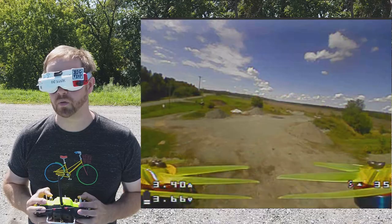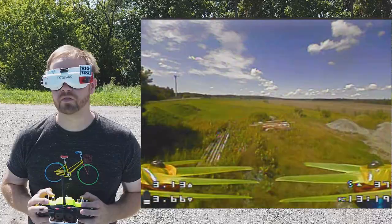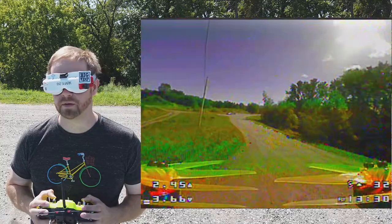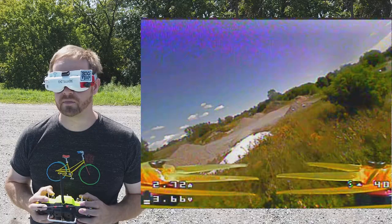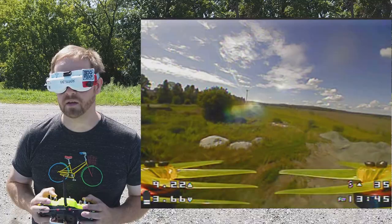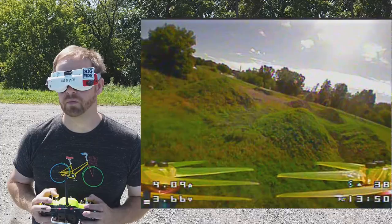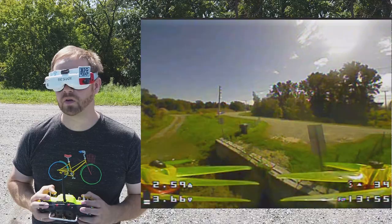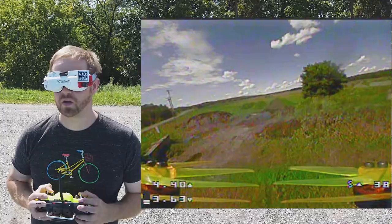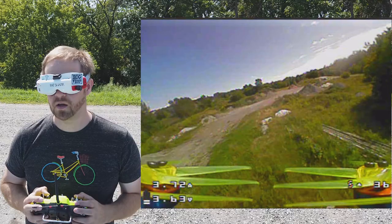And I genuinely believe there are more options for props with the M5. So when I finish this video, I'll put the exact same setup and change it. I'll just desolder those motors and put the exact same prop, same frame, everything. I'll do another video and compare both of them. I should gain more autonomy because they're 3,650 kV instead of 3,850 kV. I should see something in the efficiency, that's for sure. And the motor construction is different, so I hope to see better performance from the other one, the wire sticker.